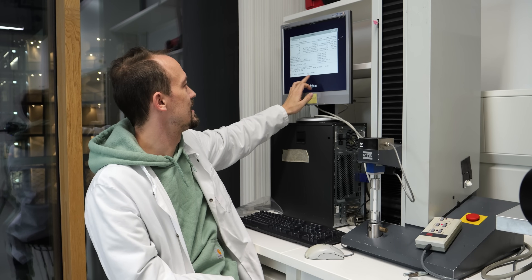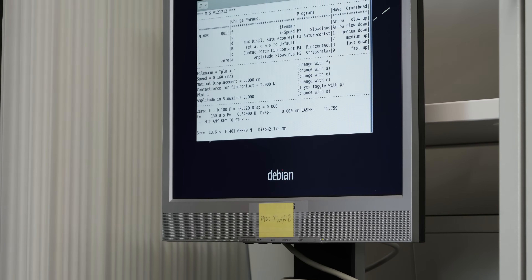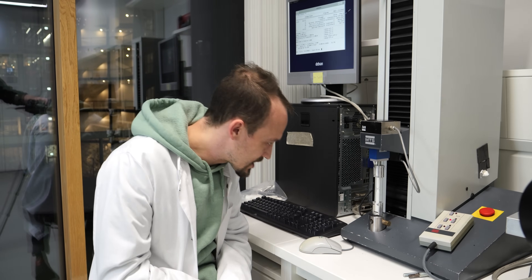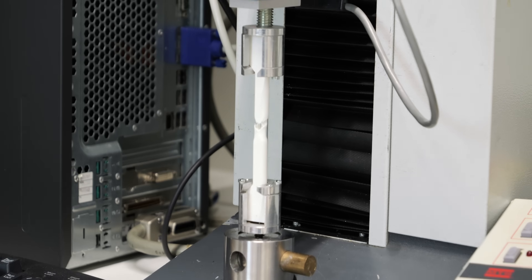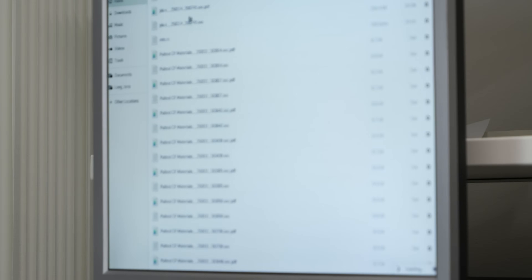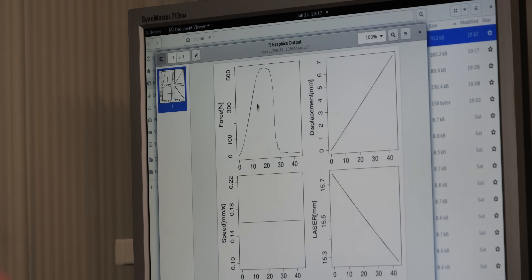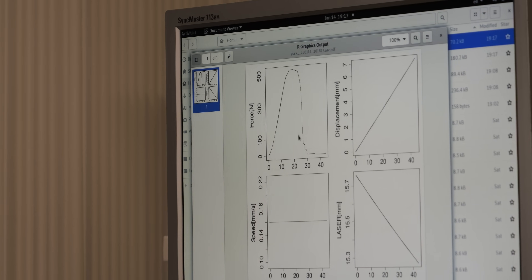It's pretty slow, but you can actually see the displacement and the newtons going up — 200 newtons, 300 newtons, around 500. This material should actually fail soon. And now it broke. It breaks very slowly, but that's exactly what we want. So the machine stops at 7 millimeters of displacement and we're already in negative forces of about 3 newtons, which is okay because we had a preload of about that. The machine produces a graph showing strain — that's all still elastic deformation — and then you see this little notch where we go into plastic deformation, and here is the fail point where it goes down. Let's do all the others and then we'll see.